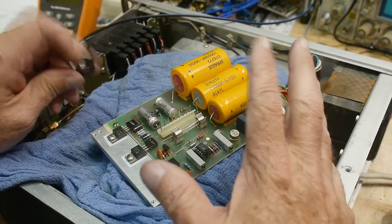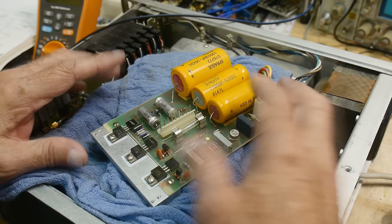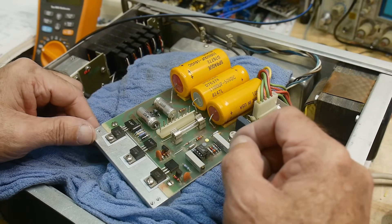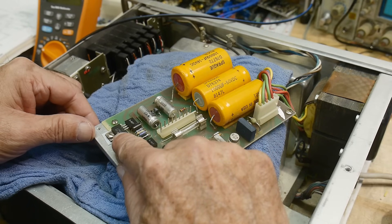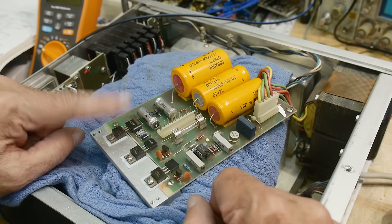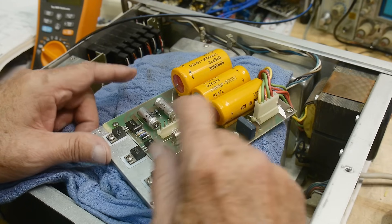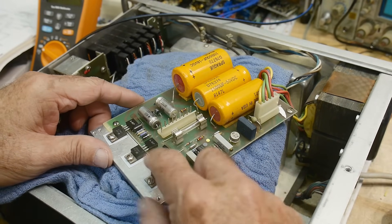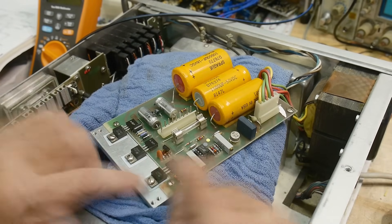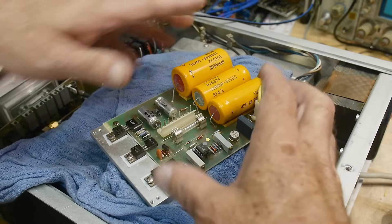So we can go to the next step and see if it actually generates any voltage. I looked at the layout of everything, figuring out what could be bad, what could be good. I noticed there's something like an LM317 — an adjustable regulator — and an LM395. I'm not sure what a 395 is, but there's two of those. They're obviously just using three-terminal regulators, and they have sockets on the board, and they just slide them on.